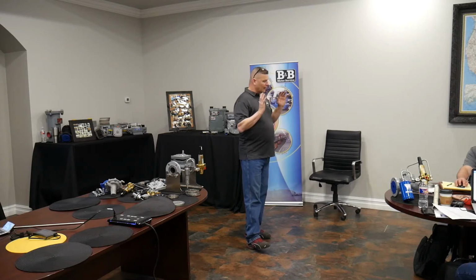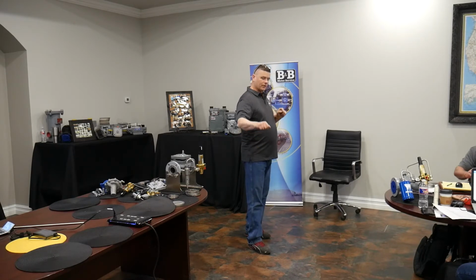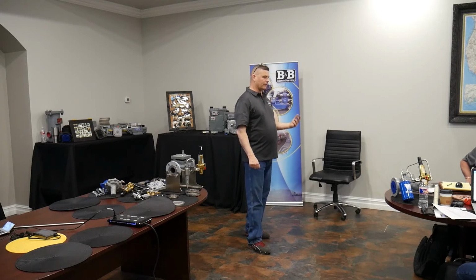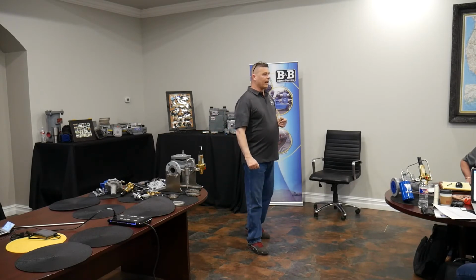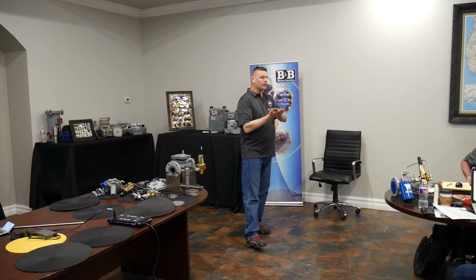So again, just a thumb rule, if you have greater than 3 times the inlet pressure compared to your set point, you're going to see that boost in capacity, that critical flow, that sonic velocity. And we'll do valve spec and I'll prove it to you. So that you can use this formula. Absolutely. Because of the critical flow. And you have to use this chart.